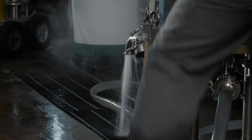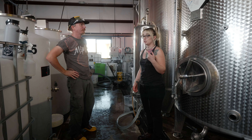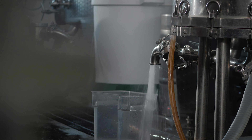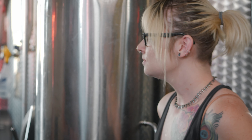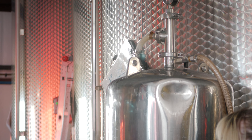I think this is about as clear as we're going to get it. When we first started, we were doing a filter on our strawberry sweethearts, which we need to have ready for Valentine's Day. We got partway — about 300 gallons into 800 gallons — and we realized that the filter wasn't really clearing anything anymore. So we had to stop what we're doing and we're doing basically a filter reconstruction.